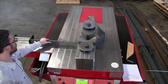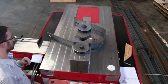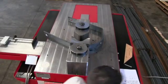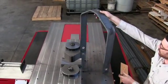I move the piece back and step on the pedal and it moves the slide up. Then I will need to step on the pedal again to move the RAM. The RAM moves back automatically because of the mode that I have the program in. There are three different modes: you can do step by step, semi-auto, and full-auto.